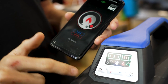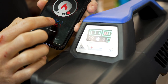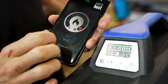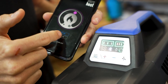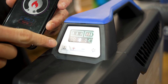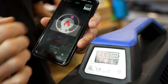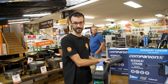From the app you can turn the unit off, but you need to return to the physical control panel to turn it back on. Pressing the heat button in the app asks for confirmation, and once confirmed the flame goes out. You can still run the fan independently without heat. Pressing heat on again re-ignites the piezo and the unit lights back up — so you can control heating from inside the tent without getting up. At the end of the night, pressing turn off triggers the 90 second cool-down phase before the unit shuts down completely.